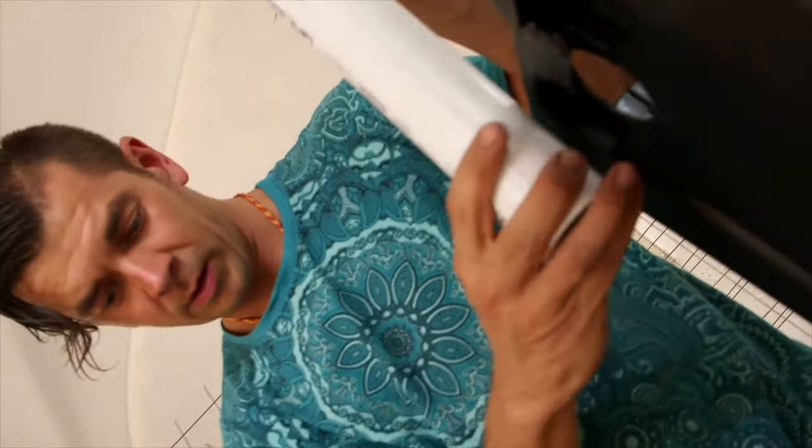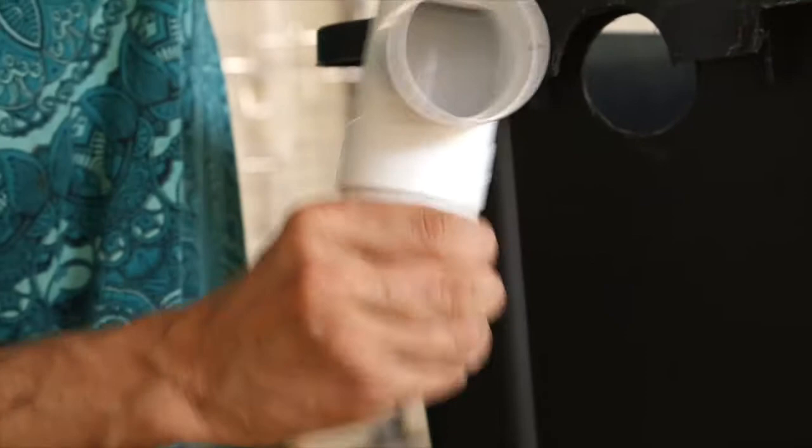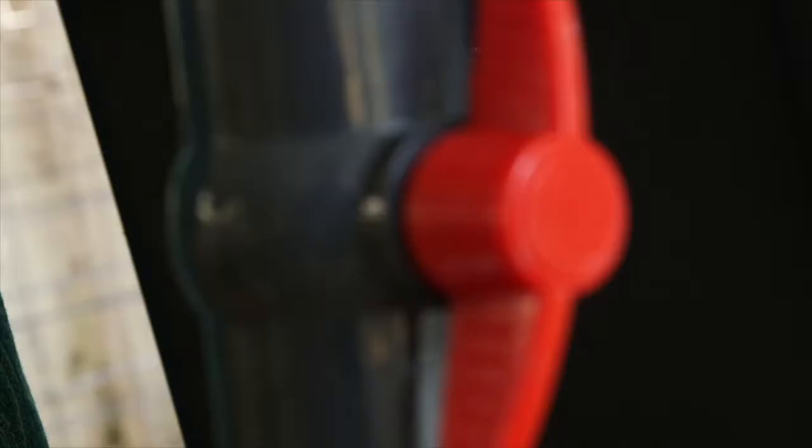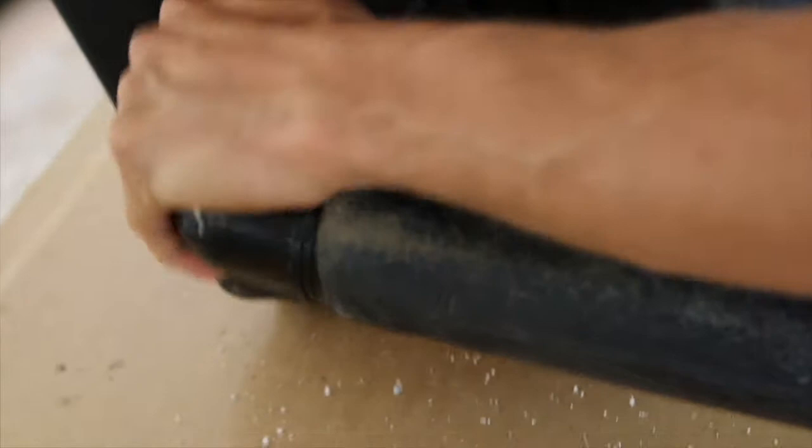When you're ready to position your inlet pipes, cut it roughly two centimeters higher than the inlet hole that you've cut out. After you've cut the pipe you'll have all those burrs — just run your finger all the way around and remove them easily. After that, connect your T-piece onto that pipe. At the bottom of the T-piece you connect a valve with a short piece of pipe and measure up the rest of the pipe that's needed to get that water straight to the drain. Insert your pipe into the inlet of the box and fit it snug into the T-piece.